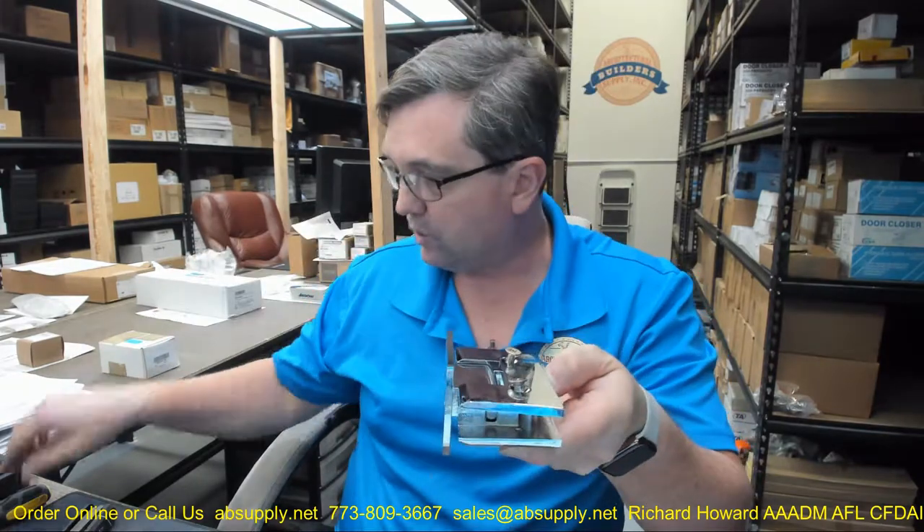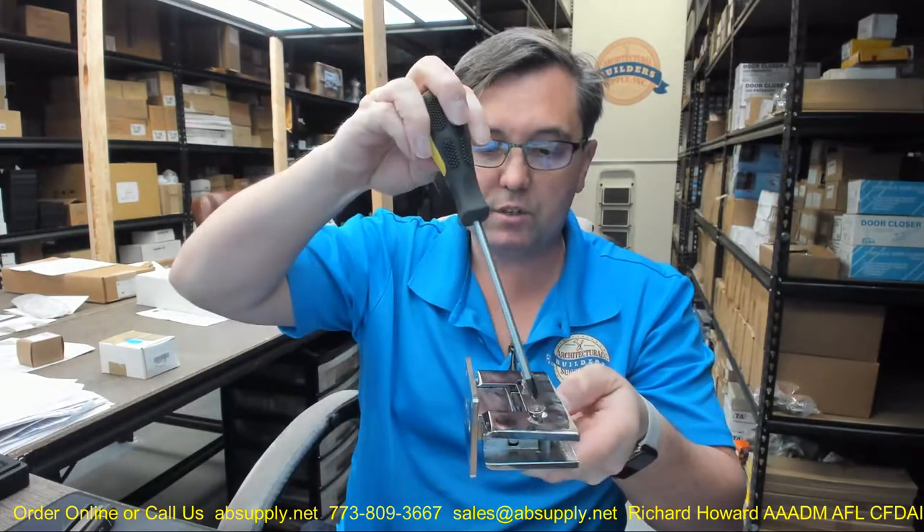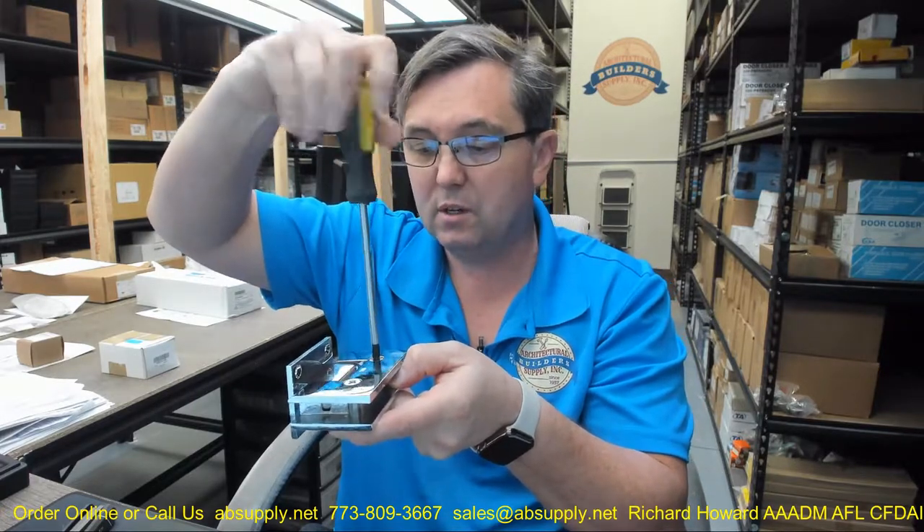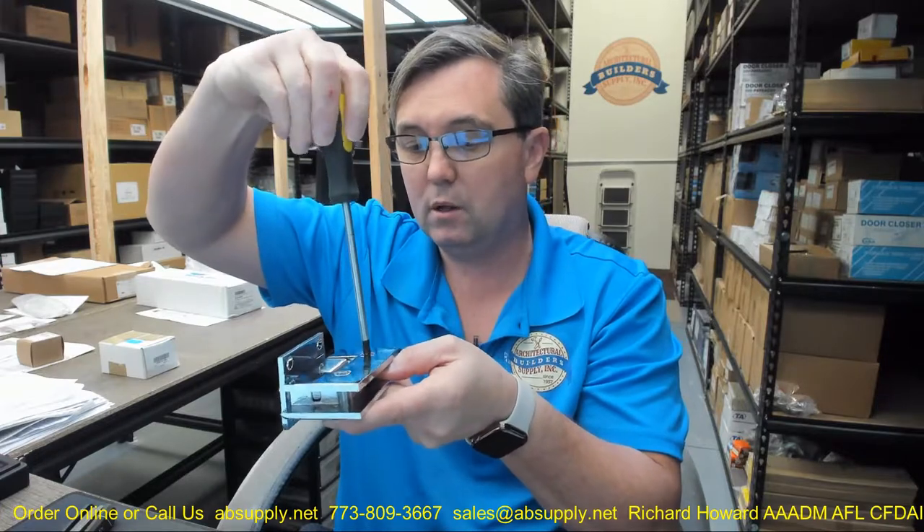The two little plastic bushings are for those mouse ear pins, which you can remove again if you need to. You very likely will remove them. I'm putting the plate back on with the two Phillips screws. What's really great about CR Lawrence products on their shower door stuff is that it's made of solid brass. The parts getting the architectural finishes are brass, and brass being an architectural metal permits an exceptionally good finish.